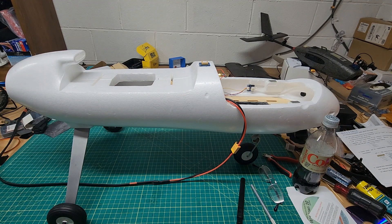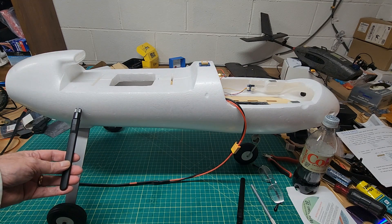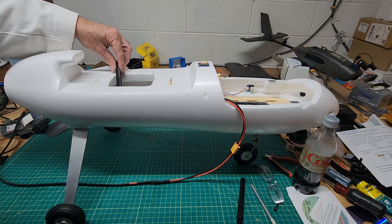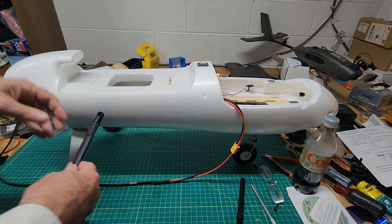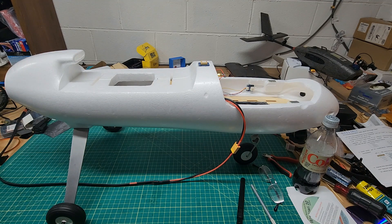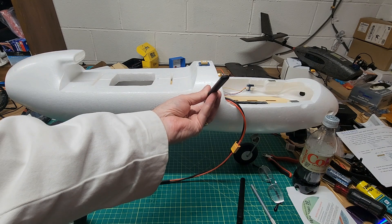This is the last thing I really have to do. The fuselage narrows as it comes back, so I can't get the antennas through the rear portion. That's why I can't route them back there to put them through. It's going to look weird if they're coming out the side pointed down, but it would be functional. Up here they could point up — it would still look weird, but be functional — though I worry it's so close to the GPS.